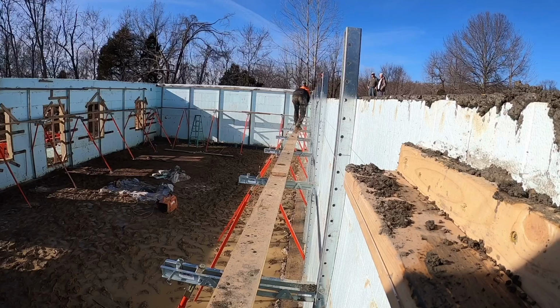The reason for that is, as I've explained before, these braces will push very well, and these plumb wall braces push exceptionally well based on where the turnbuckle is, where the adjustment is, and I covered that in one of the previous videos as well. But they don't pull near as good. They will pull if you've got them staked down good, but they do a lot better job of pushing. They're designed to push, not so much pull, and it's very difficult to get a wall line that's leaning out. It's very easy to get a wall line that's leaning in.